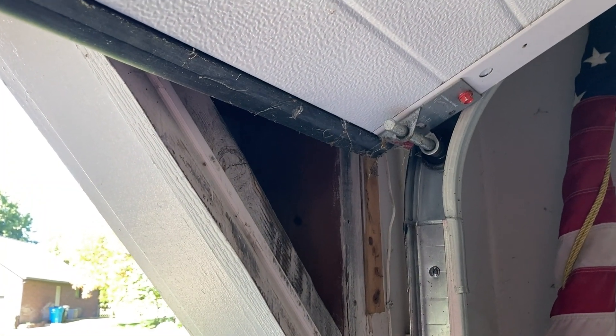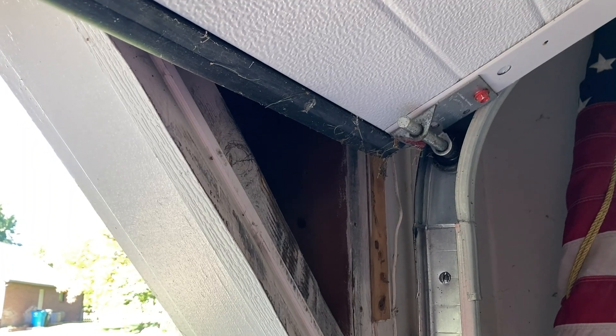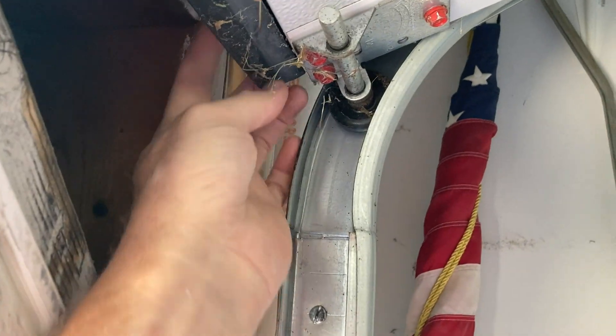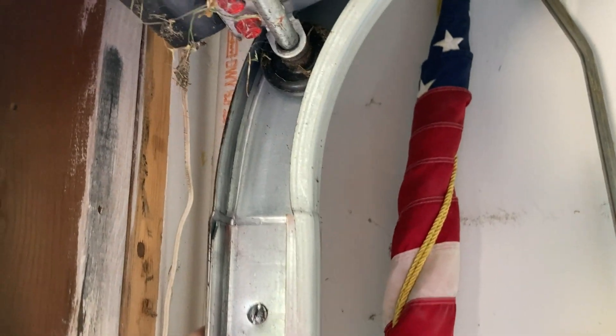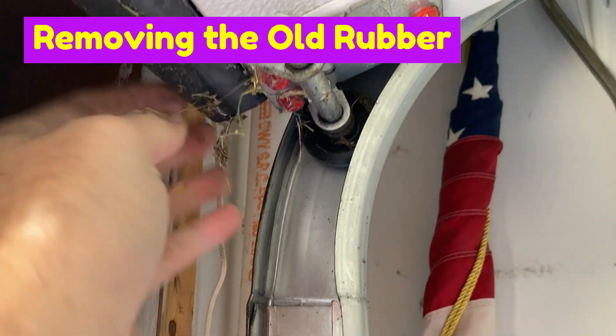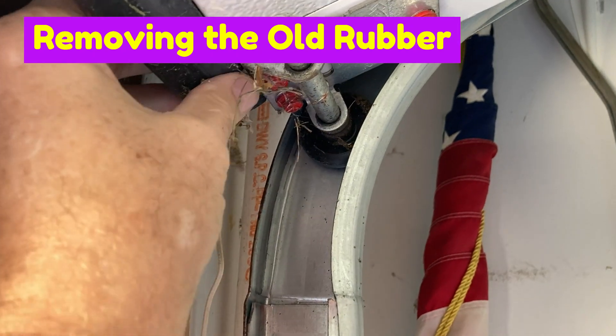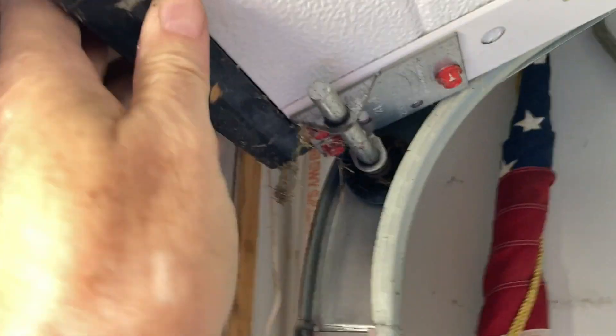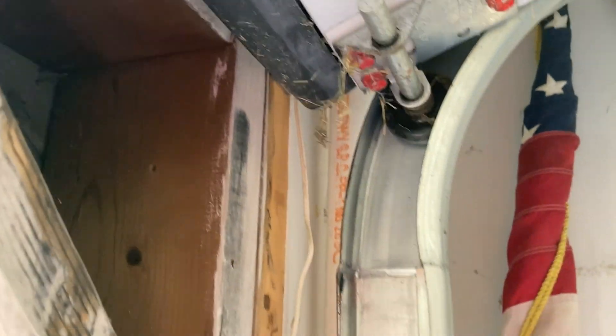So that's when I bought the kit. I unlatched the garage door from the garage door opener so I've got a little room to play with. At this position, you can see the rubber seal is past the rails for the wheels. Check each end of the rubber to make sure there's not a lock screw in there — sometimes you put a screw in there to keep it from moving. Then we're going to try and slide this out from this end. We'll get just a couple feet to work with. This groove's been pinched so I'm going to have to pry this open so I can slide it out.